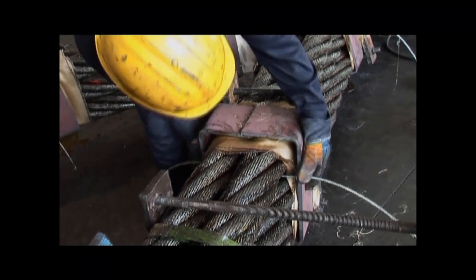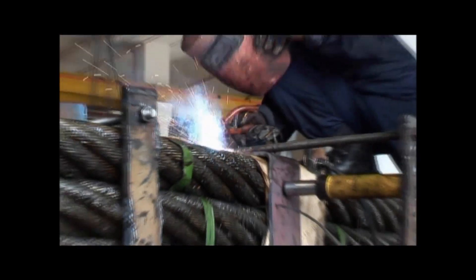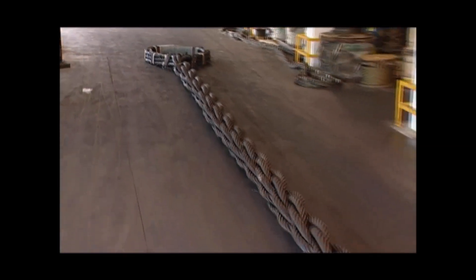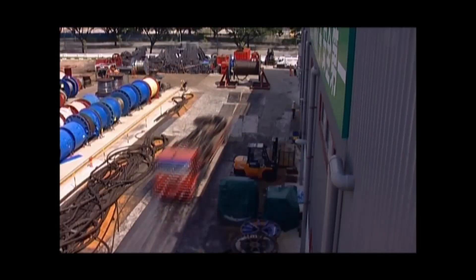A fireproof blanket together with clamps welded on the component ropes will be applied on both ends. The wire rope will be weaved to secure the finished Flemish eyes for the 18-inch rope. The finished rope is then labeled and is ready to be transported for testing.